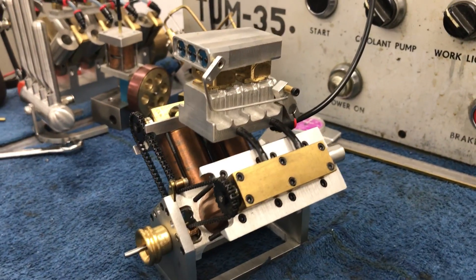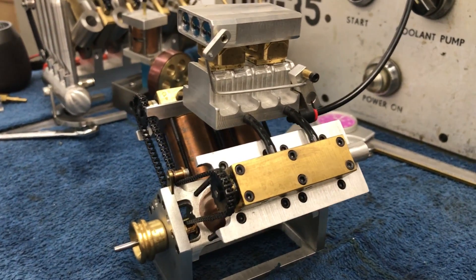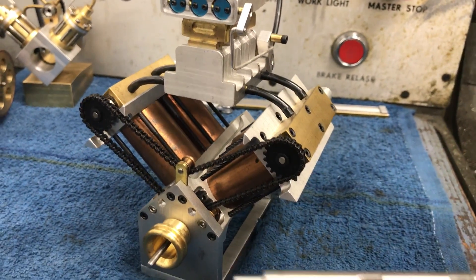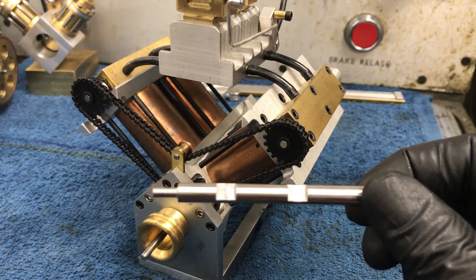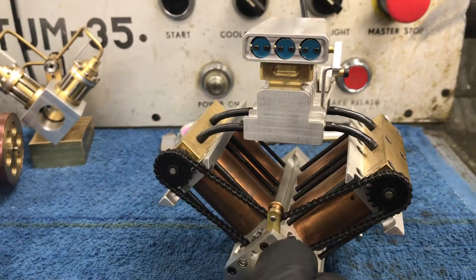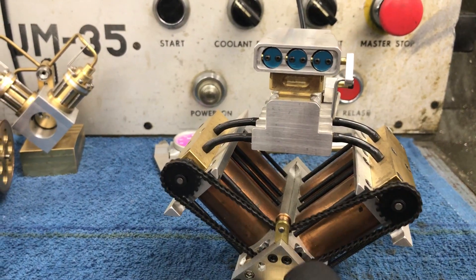I got the idea from my little one. Once I proofed out the fact that I could make a camshaft that would actuate the air in and out, I got the crazy idea of making a big dog. So I machined little camshafts — they have little intake valves, little exhaust valves. I used some small timing chain again, and it drives the dual overhead cams.